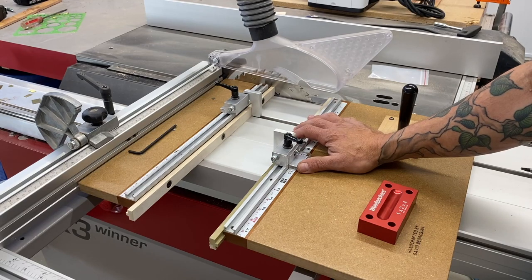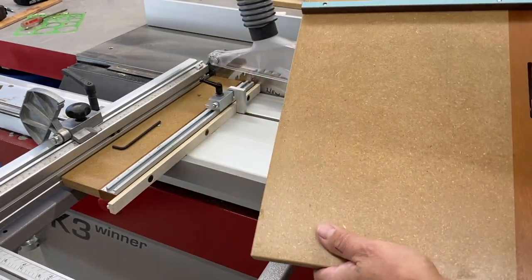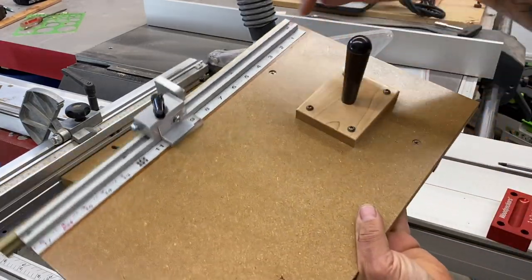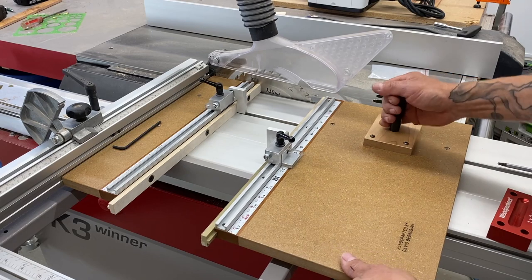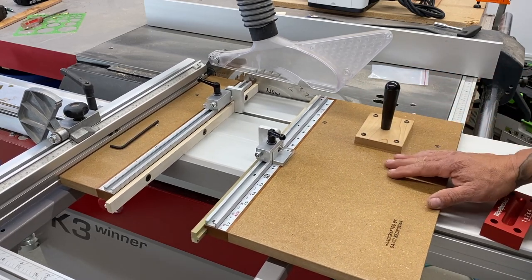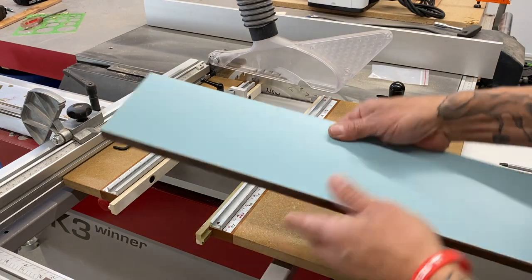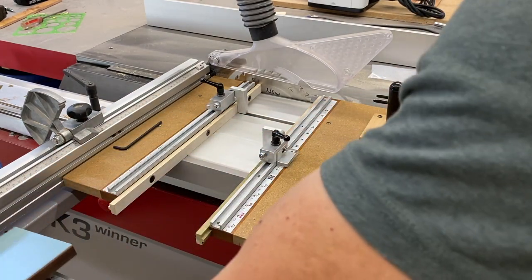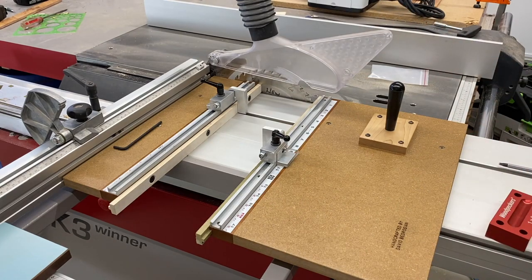I've got everything assembled and set up, and I even had some leftover conversion varnish so I went ahead and put conversion varnish on these. I used a strip of phenolic for this guide and I was able to tap threads in the phenolic to hold it in place — there is zero slack on that. Phenolic is extremely stable; it's basically like a big thick chunk of formica — resins compressed with heat to create a very stable, plastic-like material. That's what I used for the runners that go in the groove slot.